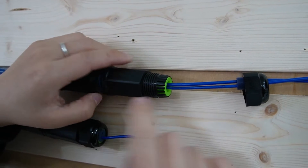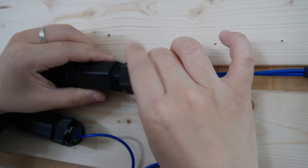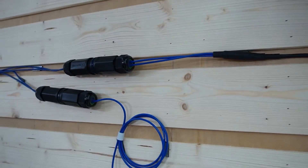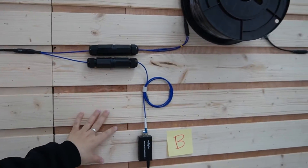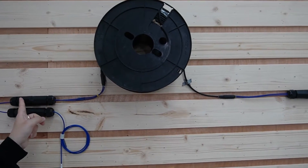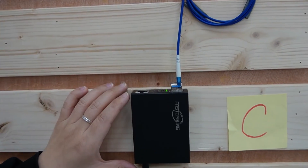Just close the cap — here we have the rubber seal, and on this side we also have a rubber seal. Push it in to make sure nothing gets in, and fasten up the gland. Make sure you use a wrench to twist it tightly. You can even bury this thing underground. Coming over here, we have the two-strand fiber optic cable all the way to Location B. Use one of the strands to connect via LC connector to another media converter for more devices. And for the last location, we use the LC coupler, another fiber optic cable, and another LC connector — and now we are at Location C.